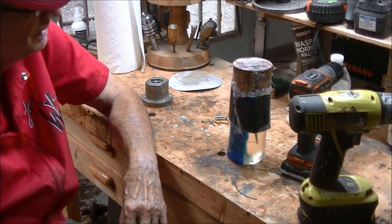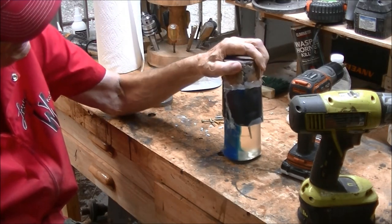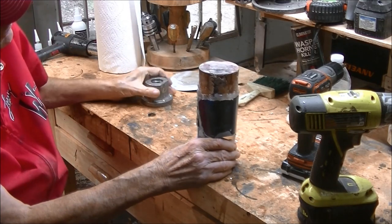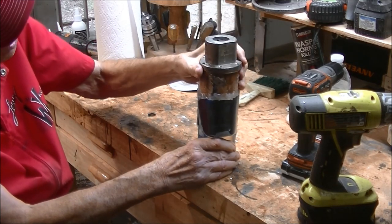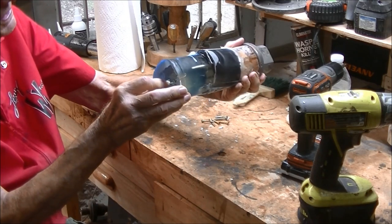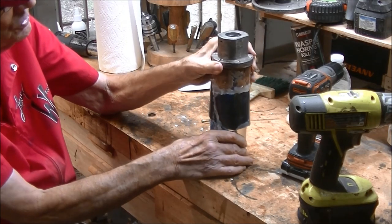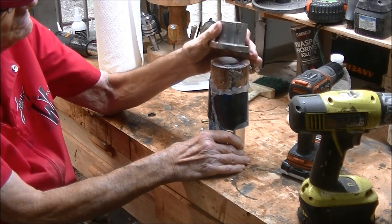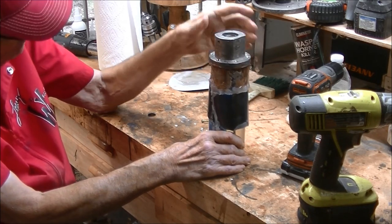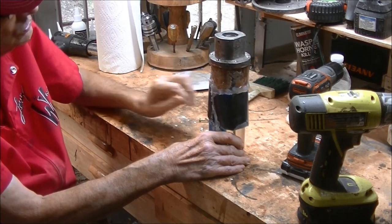And I'll show you how I'm doing that. Now, I know this is probably not flat in relation to this, so if I put a faceplate on it right here, it's just almost too big. The chances of me hitting my center is probably not very good, so I'm going to show you how I do that. The first thing I'm going to do is sit up here, drill some holes, and put my screws in very loosely